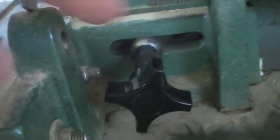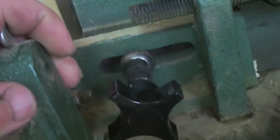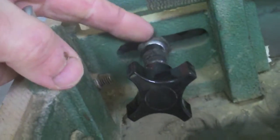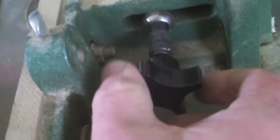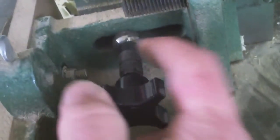That can either cause the fence to tip back or tip forward, depending on where your slot is machined. By using these big, hard, flat steel washers, there is no doming and therefore no centering. I noticed that mine was doing exactly that prior to making these replacements — I would tighten it up with a pair of vice grips and it would lift ever so slightly.